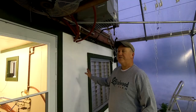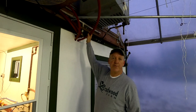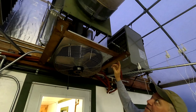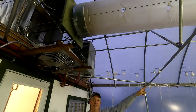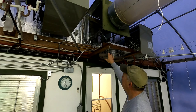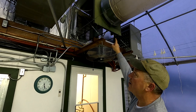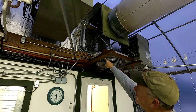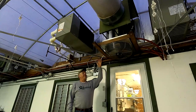These pipes come in from the wood burner and go into this heat exchanger. I put a fan on it to blow air straight up into the jet fan that feeds the greenhouse through the insulation tube. In this area we've got our main gas heater, backup gas heater, and the wood burner heat exchanger. Everything gets forced into the jet fan system, which also has automatic louvers — all controlled by the iGrow system. There are duplicate systems on the other side of the greenhouse as well.